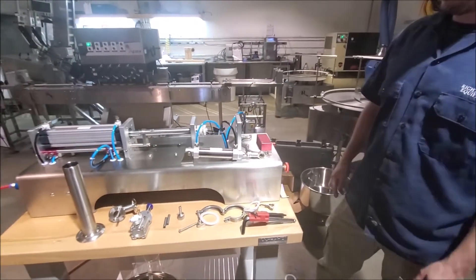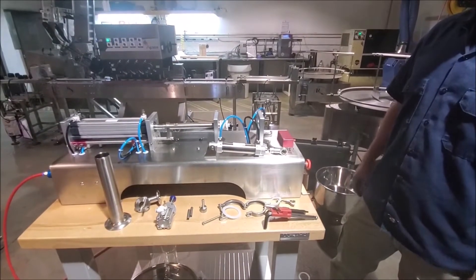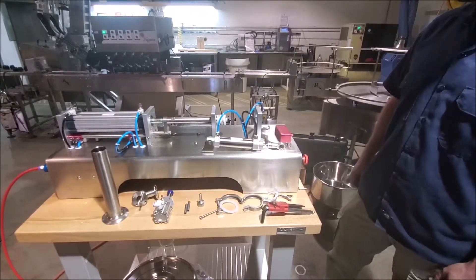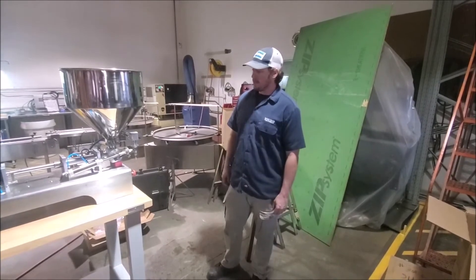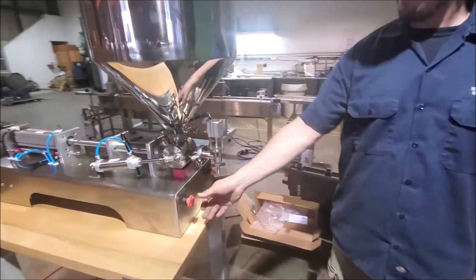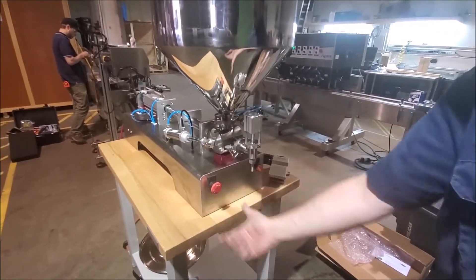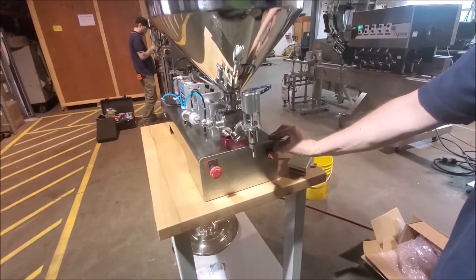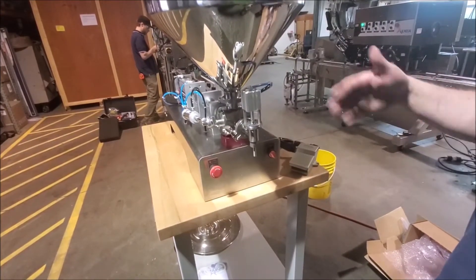So that's breaking down the system. We put it back together the same way we took it apart. We're back with the piston filler — we got it all back together and now we're going to go over the operation of the machine. On the front side here we have two buttons: we have an e-stop — press it, it's going to shut the system down; twist to release. And we have a toggle switch to go between manual and automatic mode. Manual mode will utilize your foot switch. Automatic mode is just going to continually cycle.